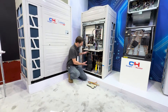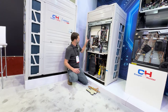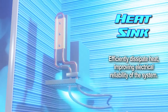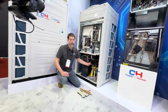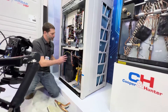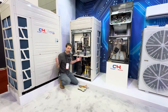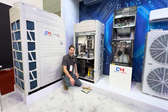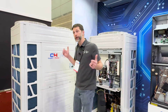The compressor is an inverter compressor. On these smaller systems you have one compressor with one IPM — an intelligent power module — with a refrigerant heat exchanger to power the compressor, and this right here is your heat sink, so you don't need air crossing the heat exchanger of the IPM. In the back there's a large accumulator, as big as the compressor itself, because it can connect to so many different indoor units. This is designed for large commercial applications, but you can get as small as a six-ton VRF system on three phase. I hope this video has helped you understand the differences between multi-zone mini-splits, mini VRF, and VRF systems.